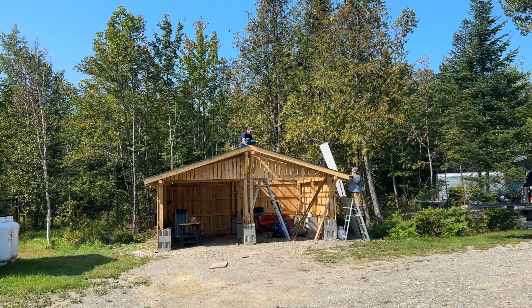All right, so as far as how we did the roof here, basically we have this panel and then we have the last panel on the other end, and we added screws to every one of the strapping that we had, and the strapping are going to be these pieces right here. After this panel, everything else we skipped a piece. So I'll show you here. We got this last row, then we skip a row, and then we got that row, etc.